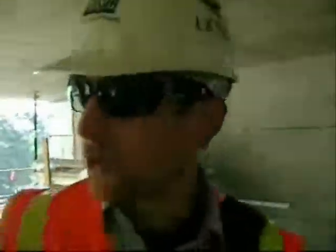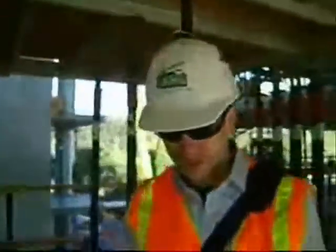We can get a better view of the construction that's currently going on. Okay. Now, what we have in this area is actually a construction sequence issue, and we haven't explained this yet, but our floor slabs have what are called post-tensioning tendons inside of the slab. They don't just have the rebar that we were looking at. They actually have what are analogous to steel rubber bands put inside of the slab, at a horizontal level.